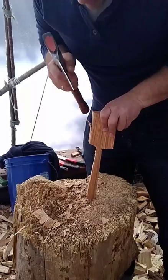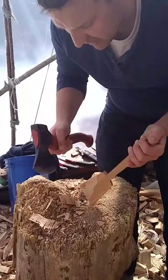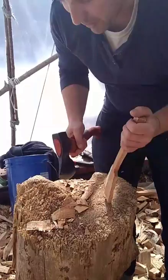So you're not going to have that right away, because it's something that you develop over time. It's a relationship with the tool. It's a relationship with the wood and the particular tree that you're working with, but anticipating when it's gonna break through and stopping that cut that happens right after it breaks through is absolutely key. Both not doing a cut after that cut and also the cut that breaks through, stopping it by having a hard stop to your hand there.